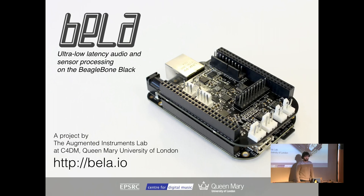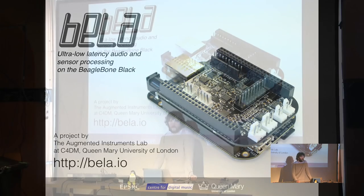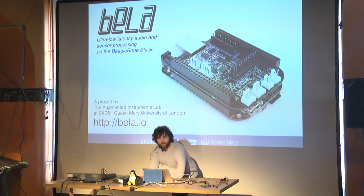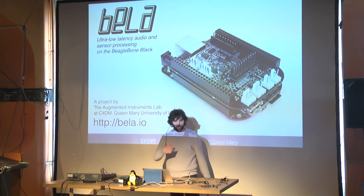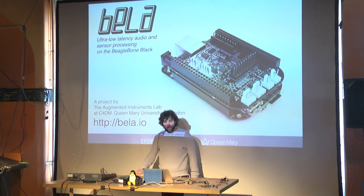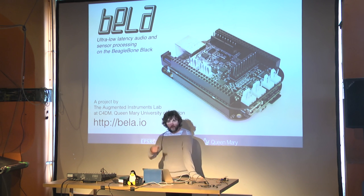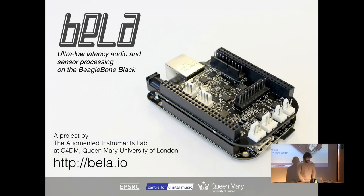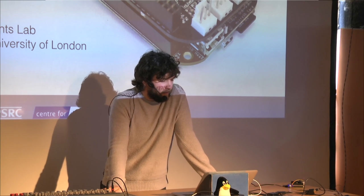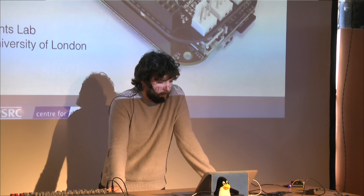They had to make a musical instrument where you could break out the internal connections of a digital musical instrument so that people could hack them on a breadboard — as if they were doing circuit bending on an analog instrument. To do that you needed plenty of I/Os, possibly at audio rate, so you could use normal values of capacitors and resistors. You needed low latency because there were multiple ins and outs, and the signal needed to go in and out a few times. That's why this platform was designed, and now it's been released as a generic platform for audio and sensor processing via a Kickstarter campaign that ended about ten days ago.